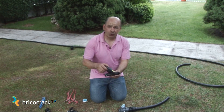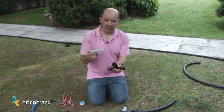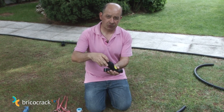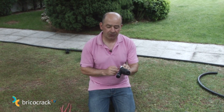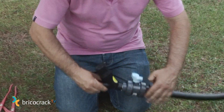The next element is a filter — a water filter. To clean it up, we simply unscrew it, remove the filter mesh, put it under the tap, and put it back inside. If we do this once per season, that should be enough. One important thing is to mind which way these elements must be aligned. They usually have an arrow pointing at the flow direction — you can't install them backwards because they won't work.